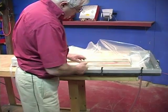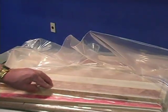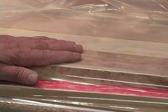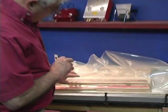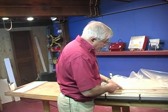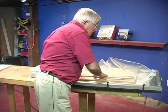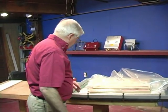We pressed this down so the bag didn't tent away — it came down and hid in the corners here, so I'm getting more side pressure. You have to look at pressure based on where vacuum is being applied. These are only a quarter inch wide pieces, and this is a one inch wide piece, so I'm applying pressure which is four times what the quarter inch would apply. So we're all tight. We'll just let this dry and we'll take it out and see what it looks like.